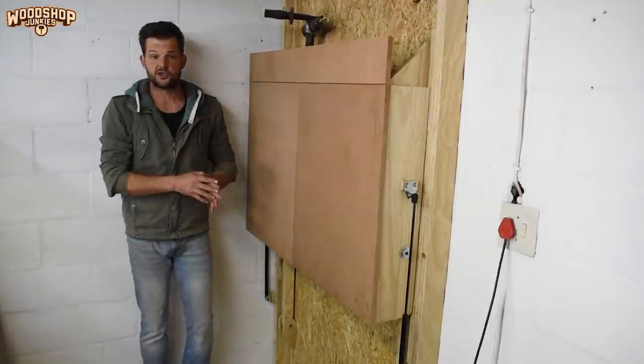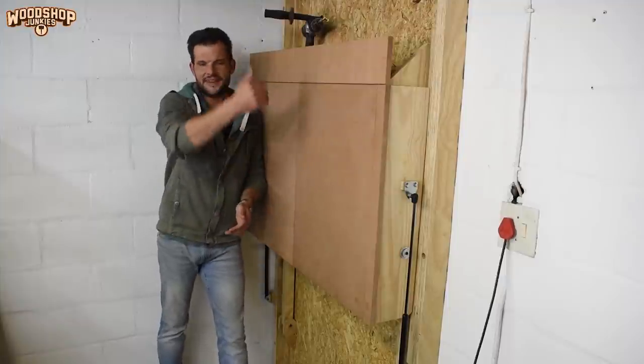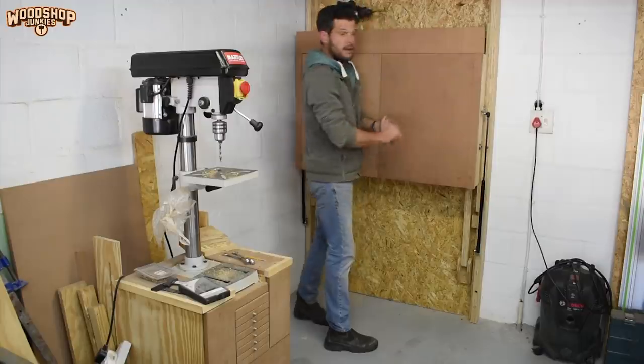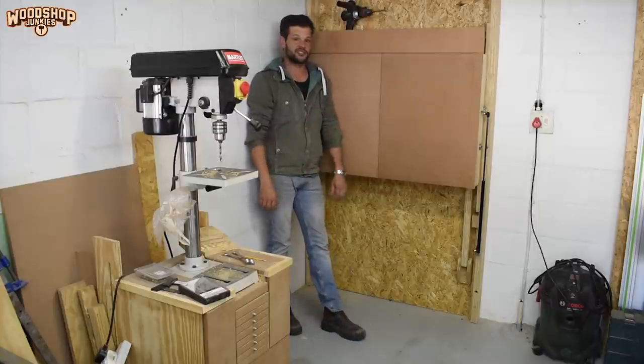So that's the two struts installed, and for the bottom mount spacer I used a piece of 1/2 inch and 3/4 inch pine plywood layered together to bring the entire assembly nice and in line with the already existing pivot. Now if I did my calculations correctly, the opening of the unit must be way more controlled because the weight is supported by the struts.